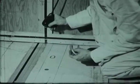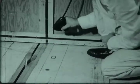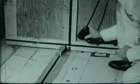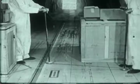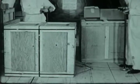A donkey may also be used in the conveyor chain for pushing purposes. Here, the donkey is placed in the conveyor behind the box of cargo, a procedure which is more convenient when a one-man unloading operation is desired. In more confined space, two pogo sticks are used in combination. The extra stick in the center keeps the conveyor cable from fouling on the cargo seen at the right. These pogo sticks fit into standard floor fittings and can be placed wherever desired in the cabin floor.